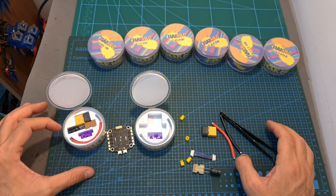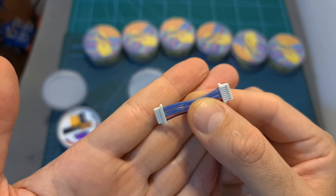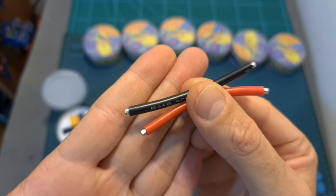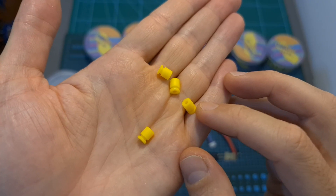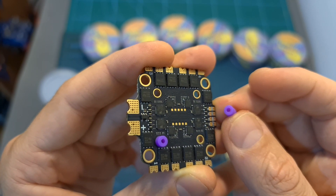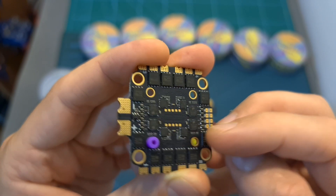In terms of packaging, with both products you can find a high-quality XT60 battery connector, an 8-pin JST harness for connecting the 4-in-1 ESC and the flight controller, two 7cm long 12-gauge battery leads, a 35V 470μF capacitor, and M4 to M3 rubber grommets. In addition, for the HK8B45 4-in-1 ESC you also get M3 to M2 rubber grommets for the 20x20mm mounting holes.